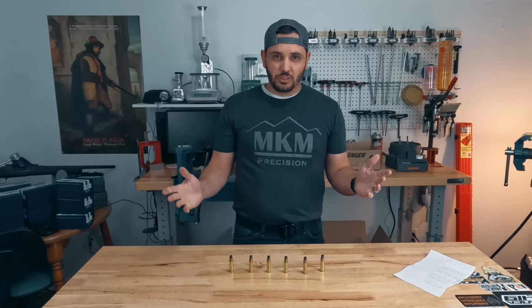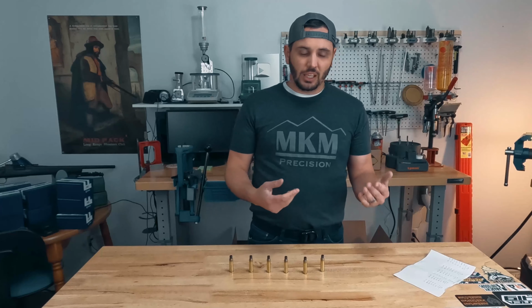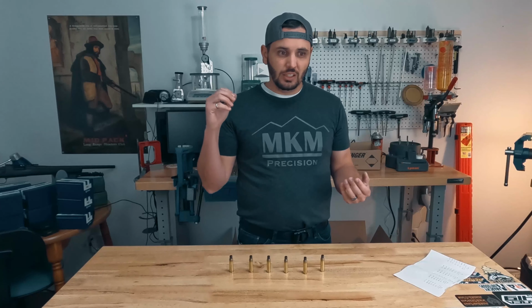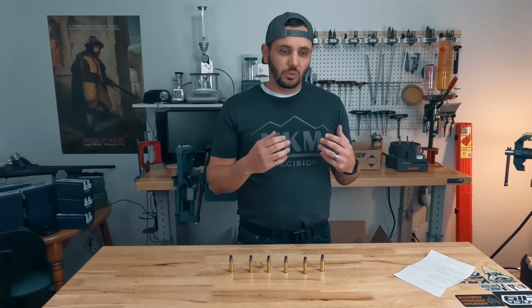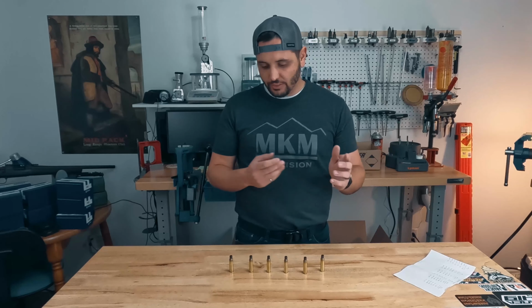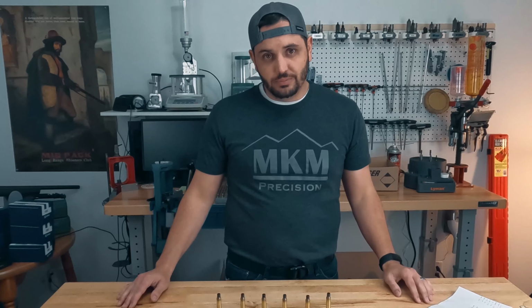Now, in metallurgy, a lot of forming, like if you think of can forming, they use fully hardened aluminum, just because that gets them the most consistent results, and they're doing stuff in compression to where it will actually form and take that without cracking. So fully hardened is going to be actually the most consistent. But we can't have fully hardened or else it's going to crack. Where do we balance this out? Where do we get these results? I don't know. The problem with these kinds of things is it leaves me with more questions than answers.